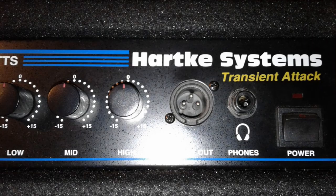The DI is working but there's no sound from the amp itself. This is already an unusual situation because typically if part of the amp doesn't work the whole thing will be affected, but here we have the front panel DI working perfectly normally while the rest of the amplifier is making no sound. We verified that there's power supply to the amplifier — the power light on the front is on — and this amplifier was known to be working during rehearsal. So what's going on?